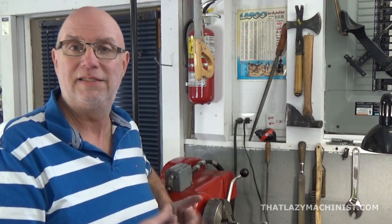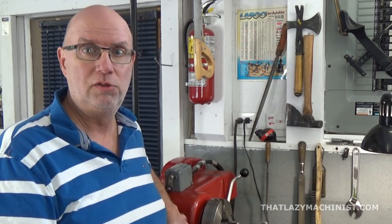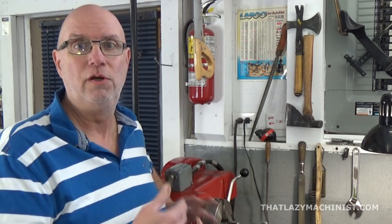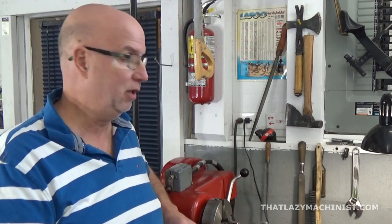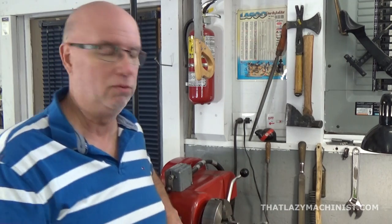Well, one of the axes has to be offset by 1 millimeter and the other by 1.73 millimeters or thereabout. And that means that I'll be moving 39 thousandths of an inch in one axis and about 68 thousandths of an inch in the other. Why thousandths? We were working in millimeters. Well, my lathe here is in inches, and I'm going to be using my cross slide to measure the amount of offset, or to make sure that I'm offsetting by the proper amount.